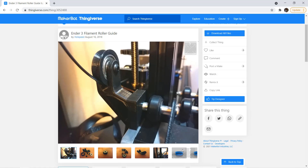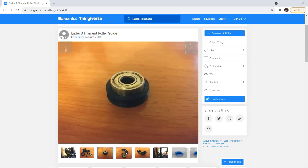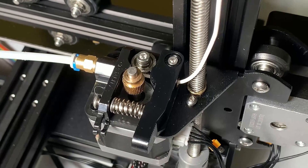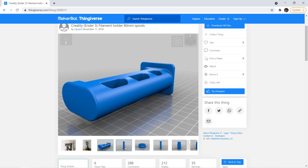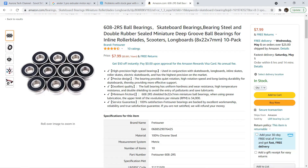Sixth, a filament guide — I would like to print some free upgrades. We will print a filament guide, as the filament roll is at the top and the angle for feeding into the extruder is very steep, which requires the extruder to pull hard. Seventh, a filament roller — I would also like to print a filament roller to replace the stock one. We will add two bearings so the filament roller moves smoothly. These are just skateboard bearings, so they are very cheap — you can get a pack of 10 or 20 for a few dollars. This upgrade could also improve filament feeding.